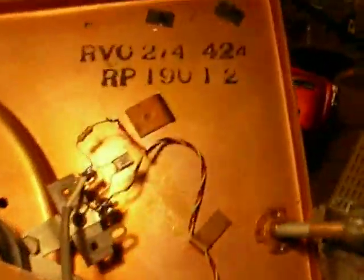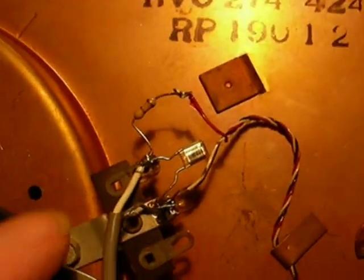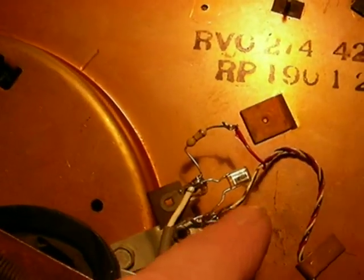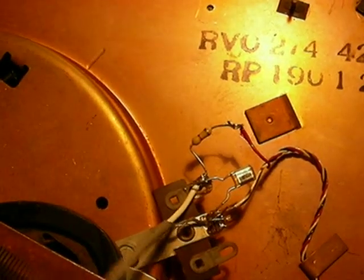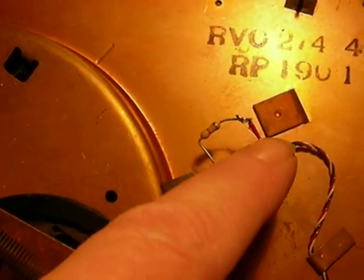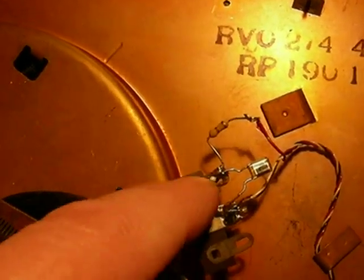On the output here, this is where I stick the 470K resistor. Coming from the tone arm, I use the black and white wire — I tie them together as grounds and they go to the ground wire, to the shielded wire, back to the amplifier. The red wire I interrupt, putting a resistor in series, then back down to the amplifier feed wire.